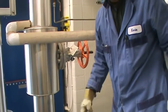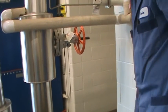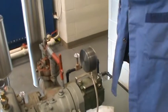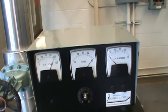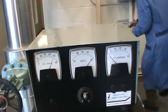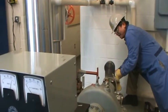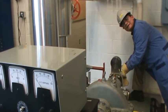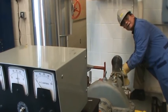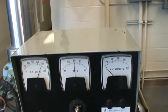The next step is to check the frequency on the generator. In North America we want 60 Hz. Right now it's almost 65, so I need to turn it down a little. By turning the governor I can slow down the turbine and the Hz will drop. Now it's at 60 and a half — I'll turn it a little more. Yes, it is 60 Hz.